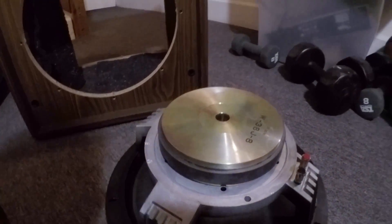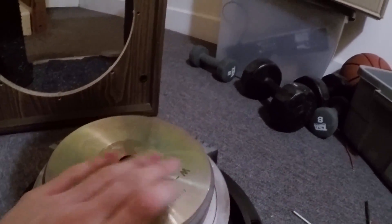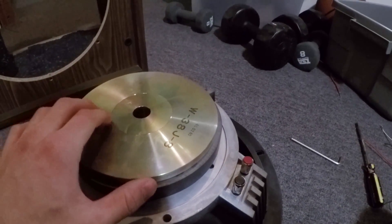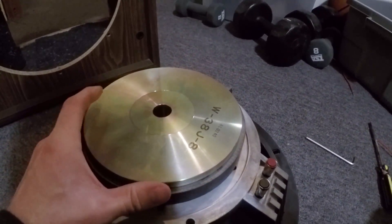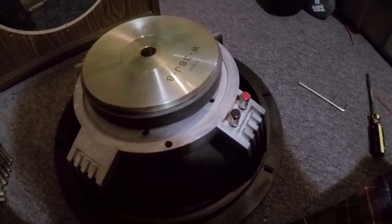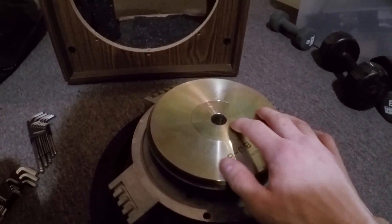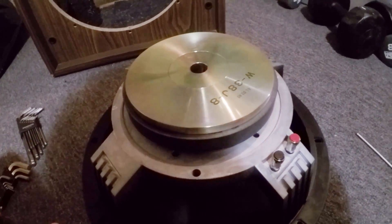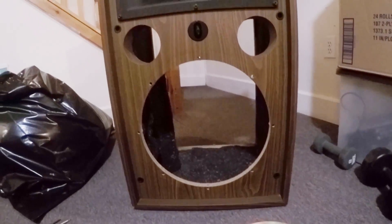Tighten the bolts back up and you should be good to go. So what I've done here is loosened up all of these bolts inside that hold the magnet on, and now you can see this thing moves around a little bit. When there's so little clearance between the voice coil and the magnet, that's really all you need. If I move it over here — yeah, now we're rubbing a lot. But if I move it back — there we go. Now I just moved it and there's no rub at all anymore. As long as you can find that point at which the speaker doesn't rub anymore, assuming your particular speaker has enough play in the magnet, you should be set. Just tighten the bolts back down, make sure the thing doesn't move while you're tightening them, throw the speaker back into the enclosure and you should be all set.